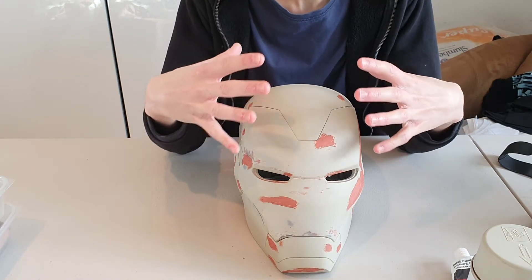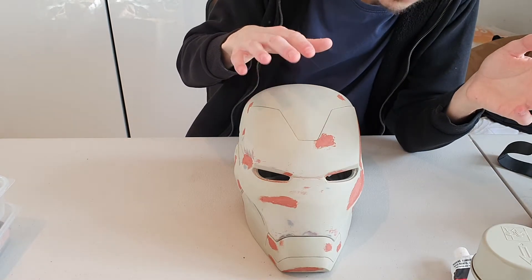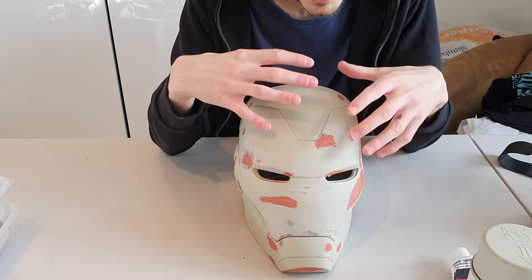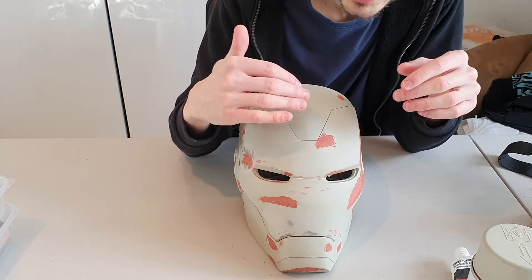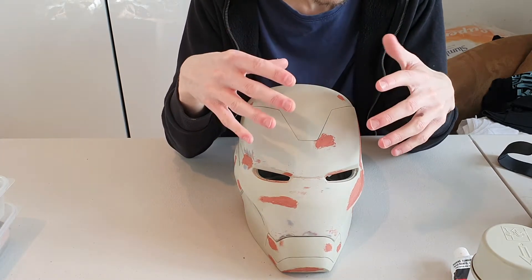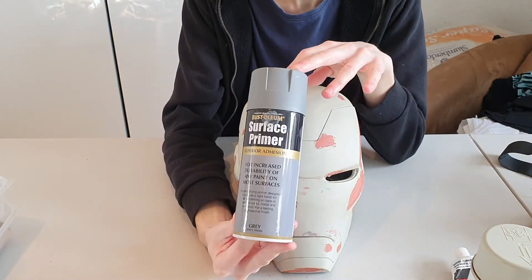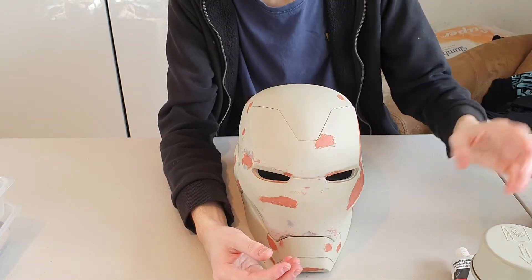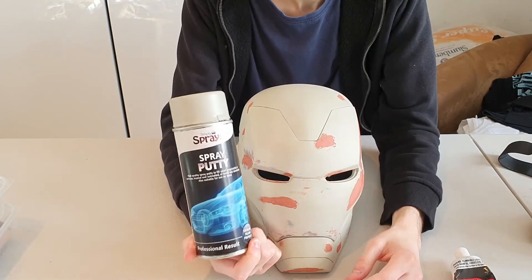I just wanted to do a quick overview of what I do, so that if people have a general bearing on what they're doing they don't have to sit through the whole video. The general premise is I use 120-grit sandpaper - I use an orbital palm sander for big pieces, but for smaller bits I hand sand. I hit it with 120 and then I get some wet and dry 240 to just take the edge off where it's picked up a little bit. That helps when you're putting the primer on. I then use a surface primer from Rustoleum - I just like grey because it shows you where you've missed some sanding.